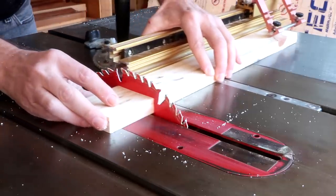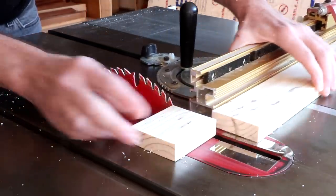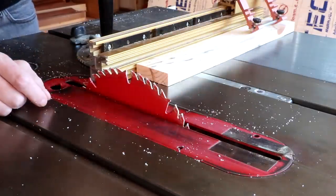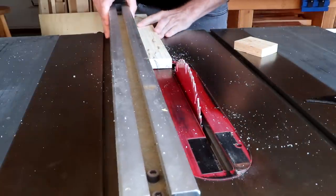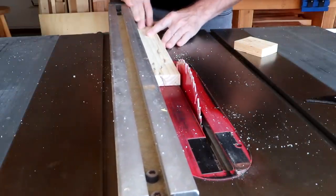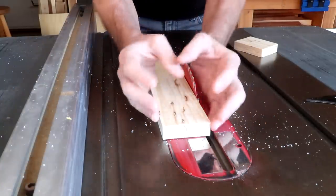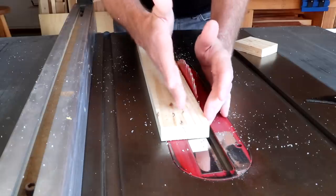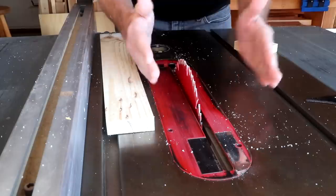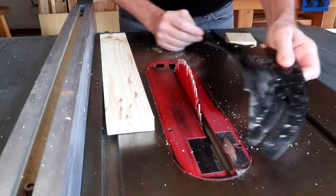On cutting a board like this, by the time it cuts all the way through the board, it's possible that this piece can come in like that. And the same applies when you're using a rip fence. In fact, you can get probably more kickback when you're ripping a long board, because what can happen is that the stress inside of this board can come together once you've made that kerf, causing it to just bind on the back of that blade. So just short answer, always make sure you have your riving knife installed.